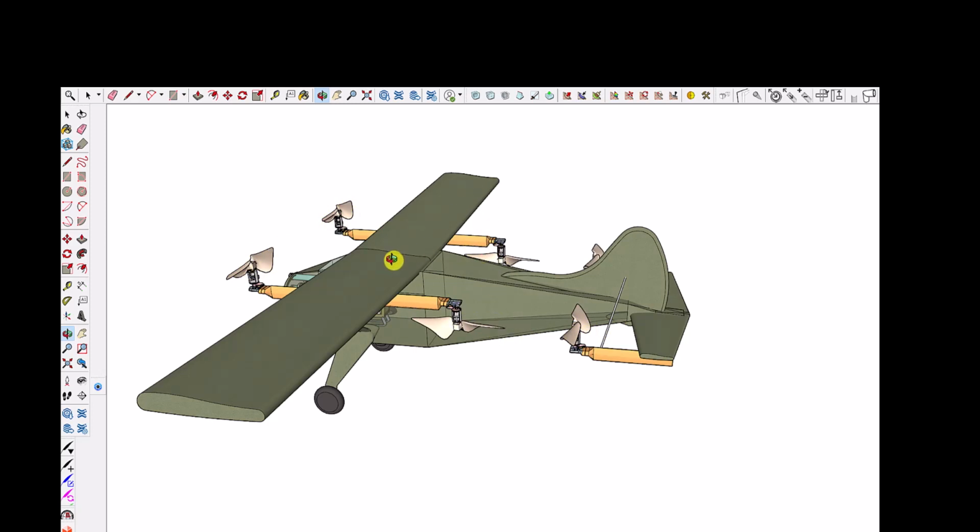That's about 800 horsepower. Well, you only need 90 horsepower to make it fly along, because fixed wing flying is so much more efficient. So these might be turning at 1800 RPM, but these four, I'm going to suggest for them to turn at maybe 100 RPM or 112 RPM. What you want to do is have them turning just fast enough that the thrust they are creating is equal to the drag that they are creating, so that they have actually no net effect on the plane.